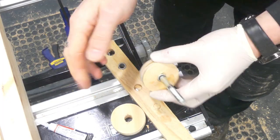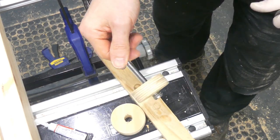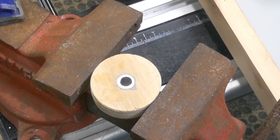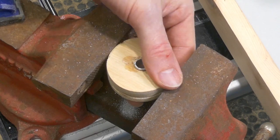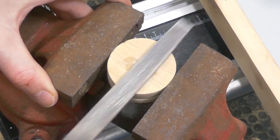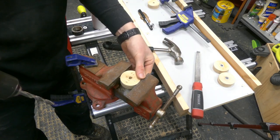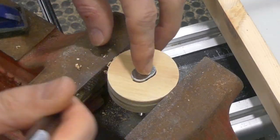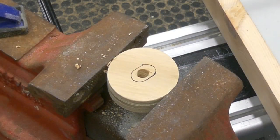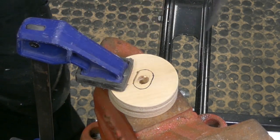Those furniture bolts I found on the side of the road and they're going to be the axles. I didn't have anything long enough to be a full solid axle, so I'm going to have to use two — one from each end. Not ideal but again, this is a pretty rubbish jig. File down the aluminium and they will be the freewheeling end of the jig. The drive end needs a way for my drill to turn the wheels, so I'm going to use T-bolts — just because that's what I happen to have lying around, but any non-round bolt should work. A bit of dodgy chisel action to mortise out the appropriate slot for the T-head.